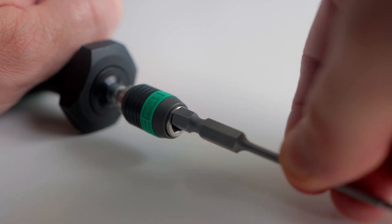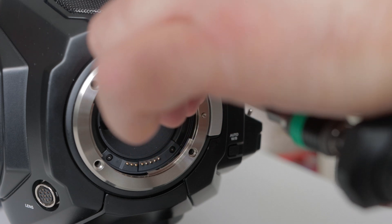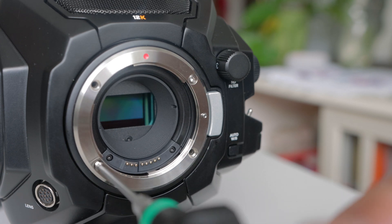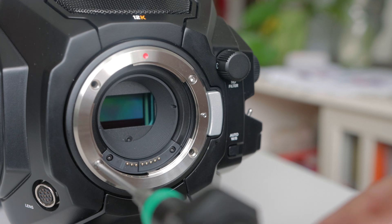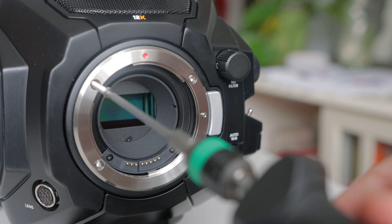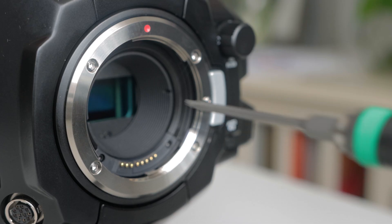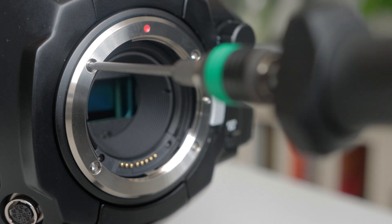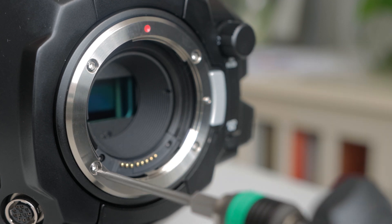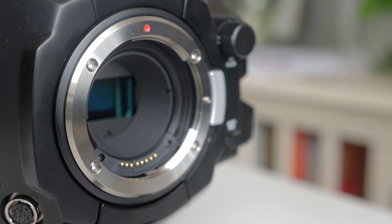Make sure your bit is placed on the screwdriver if it is not already on. Then insert one of the screws on the EF mount using the torque screwdriver, but don't tighten it all the way just yet. Add the next screw diagonally across from the first screw and screw it in, but just like the first one, don't tighten it all the way. Do the same for the last two screws. Then adjust all of the screws, carefully alternating them until you achieve around the same amount of tightness. Then do one final round to completely tighten each one in place. Because you are using a torque screwdriver that is properly set to the required amount of torque, it's impossible to under or over tighten the screws. You'll hear the torque screwdriver click and it won't tighten anymore once it hits the right amount of torque.